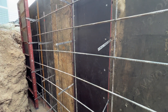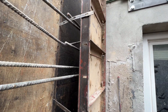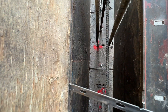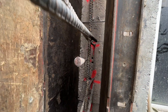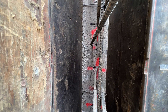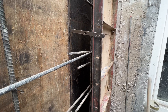We've got the rebar grid installed here and as we come around here this is where the walkout turns that concrete wall and then actually connects into the existing wall. We've got this formed up here and you can actually see we've drilled these holes and installed the rebar into the existing concrete. The process to make sure that the connection is secure and correct is to blow that out with an air compressor.